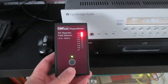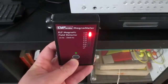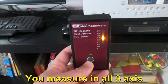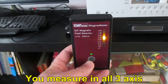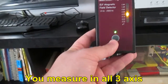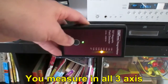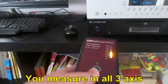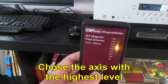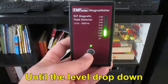You can measure safety distance. How do you measure safety distance? You find a spot where you can measure the radiation, then you measure in 3 axes. This is a single-axis meter, so we get 0.2 Microtesla — that's 2 mG — in this direction. Here you get 2, and here you get less. Let's stay with 2 and move away until it drops down.